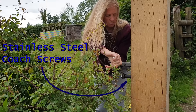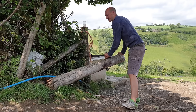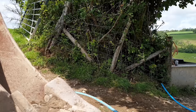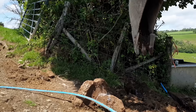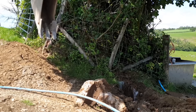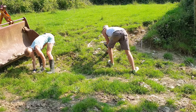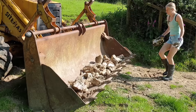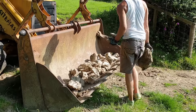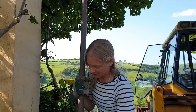Because tannins in oak react very strongly with steel, we're just putting a slip of plastic — in this case a yogurt pot — between the post and the receiving latch, and that just prevents the black staining and corrosion you'd otherwise see. This area is adjoining three different fields, so we've got two other gate posts to replace. Most people think of concrete as quite a poor solution for putting timber posts in, in terms of durability — although it is exceptionally rigid to begin with. My own dad put that post in, and there's been a whole other pressure treated post that was just round in quite shallowly in that same location. Hopefully this oak post will be there a little bit longer.